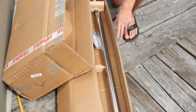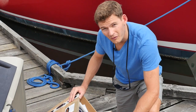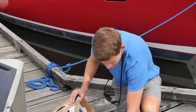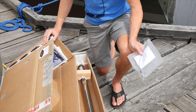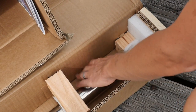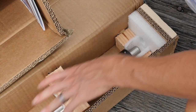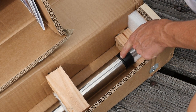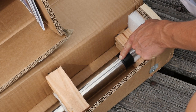The next box is the shaft assembly box. This is an L shaft, which is 58 inches in length overall. Two things to note in this box: one, the rudder locking pin is in the bottom of the box, so don't lose that. The second thing is to make sure that the shaft tube spins freely. Sometimes during shipping, the shaft can get bashed around and the collar can come loose, leaving a gap. You need to bang it back in place so that there's no friction in the system.